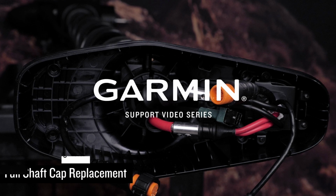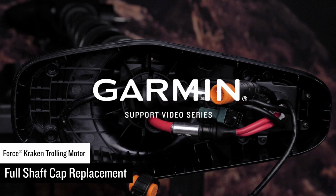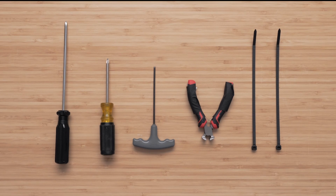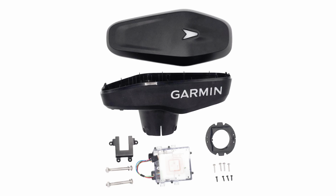Today, we're going to show you how to replace the shaft cap on the Force Kraken Trolling Motor. For this process, we will need a number 1 and number 2 Phillips head screwdriver, 2.5mm hex bit driver, clippers, zip ties, and the replacement shaft cap.